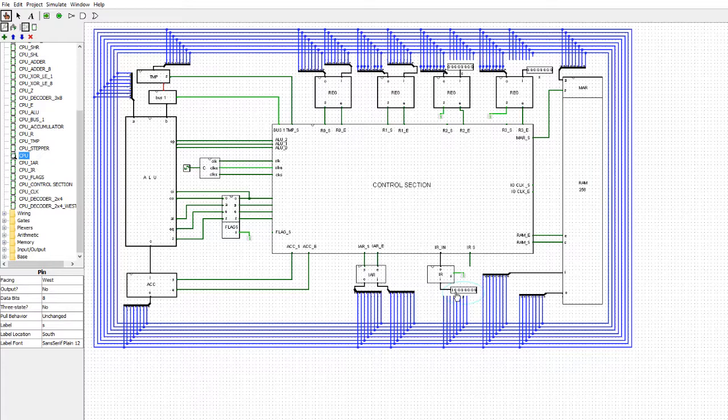So the next 3 bits will define what operation we're going to do. So we know that a 0, 0, 0 will be an add, so we'll leave it at that because that's the operation that we want to perform as an add. Okay, now we're going to look at the values that are in these 2 bits here. Okay, now that's defined as our reg A. Okay, so what we want to do is add the value that is in 1, 0, so that represents register 0 register 2.